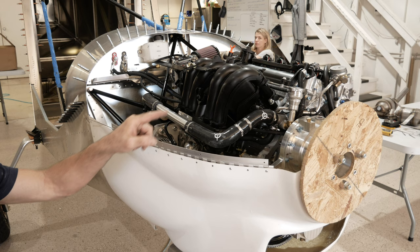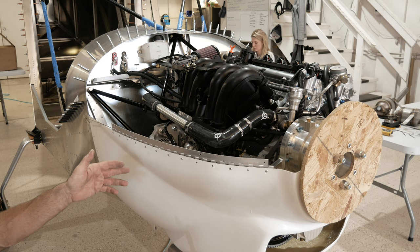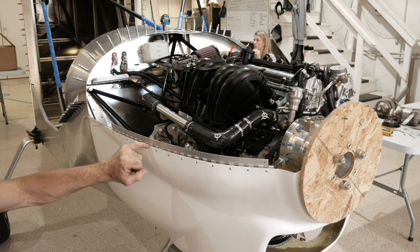We're using number 5 rivets. And pretty much every other hinge loop is where we place a rivet. There are a lot of ways you can set the height of the hinge. I like to just go right down the middle, or I take basically the bottom of the loop here and I align that with the edge.